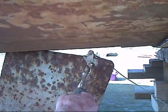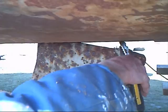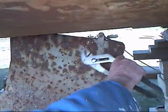Because my brother brought the crimps and the wire, and when we were crimping it with my tool he said to me it didn't feel quite right somehow. And as soon as we tried lifting it up on a winch, the crimps pulled out. It was the wrong crimps for the wire. So we used my crimps that I know work for my tool, and the next day we dropped it again and done the job again. It's a job you wouldn't want to do twice.